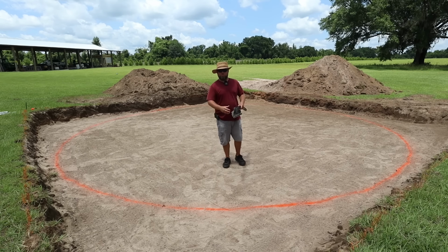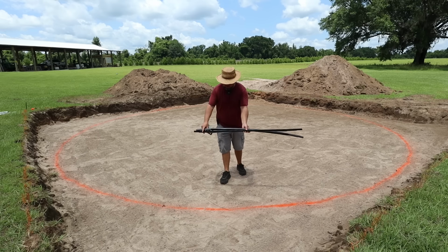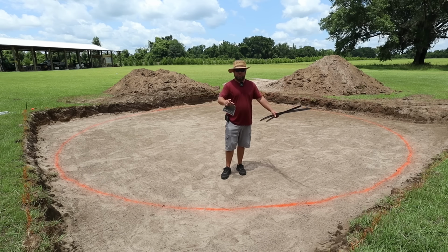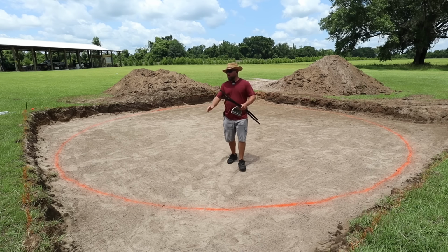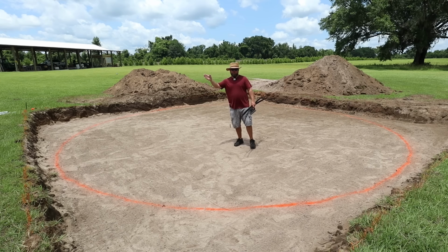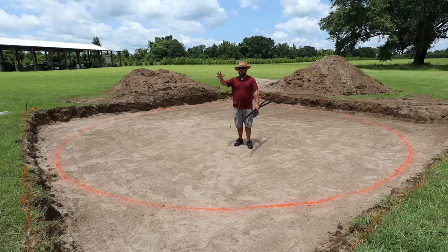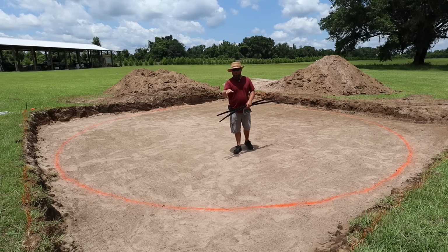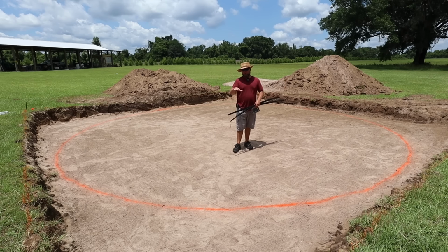The reason I went a little larger with that circle is because I'm gonna lay my track down inside of that circle. That's there just for a rough reference to make sure as I set my pool up, it's centered off of my porch, which is what I want. So when we visually walk out, the pool, the deck, everything's nice dead center of the back porch here. So digging a square hole actually makes it easier for equipment with buckets on them, like a skid steer or a tractor. Excavator doesn't matter as much, but it also really just makes things quick, easy, and better for layout.